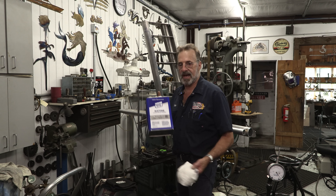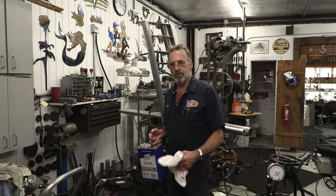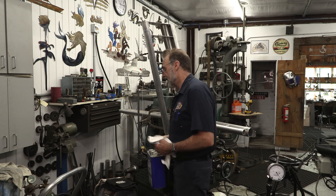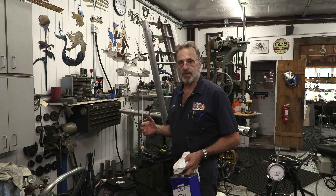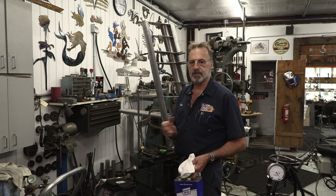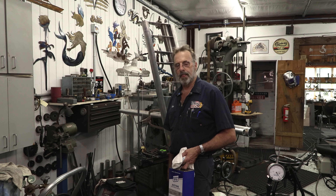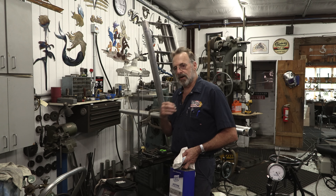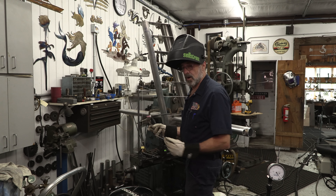In the last video, people made comments about how I'm cleaning my aluminum. In my earlier videos where I'm doing welding — like on the center spool fitting for the hydraulic crane that I rebuilt — I do mention that I clean things with acetone. I didn't really think you needed to see me actually clean with acetone, but that's how I keep the oil off and remove all the dye printing that's on the plates. It kind of does it all in one shot. I make sure all my welding areas are oil-free, because dross from the plasma cutter will also make a weld dirty.